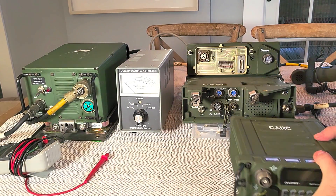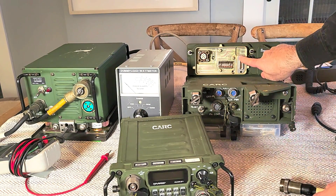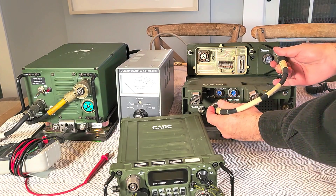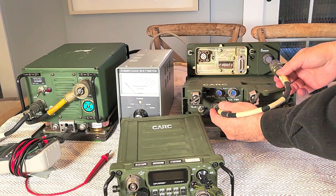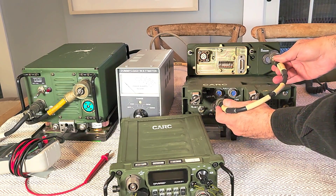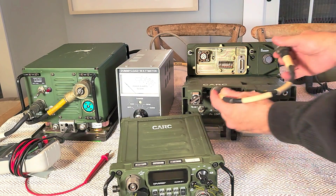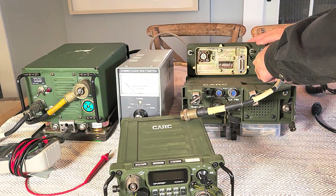The next thing is to connect this cable — it goes from the slice, which carries the back-of-radio connections, through to the accessory port on the amp. This cable will power the radio as well as tell the amplifier what frequency or frequency band has been selected for its internal bandpass filters. It also drives a coupler if we had one connected to the back. I'll connect the slice side first since it's a bit of a difficult connection.